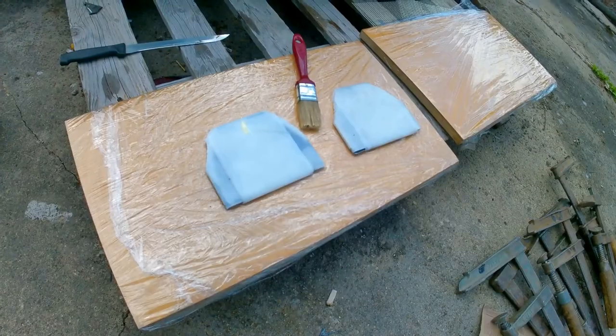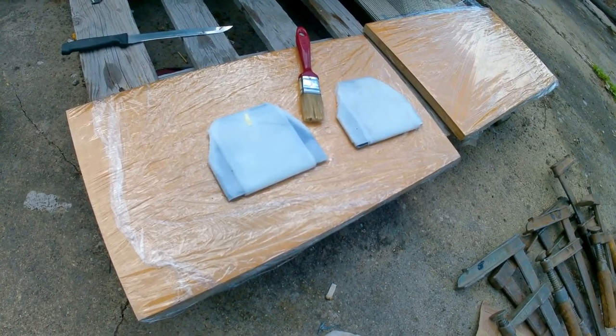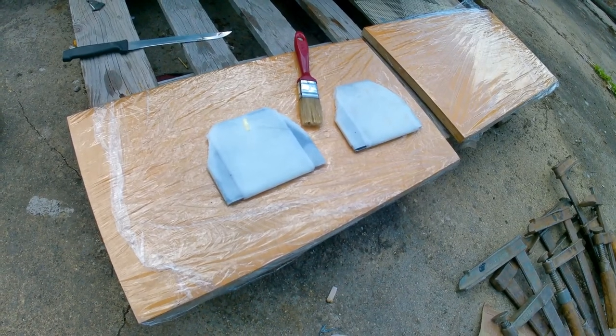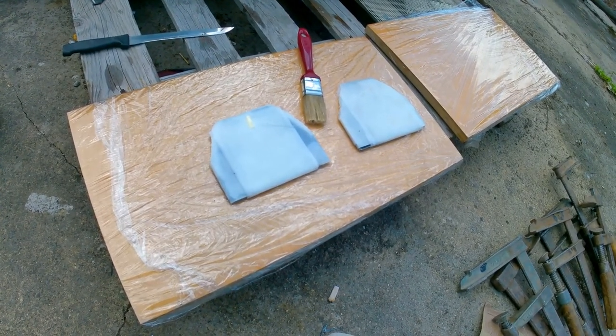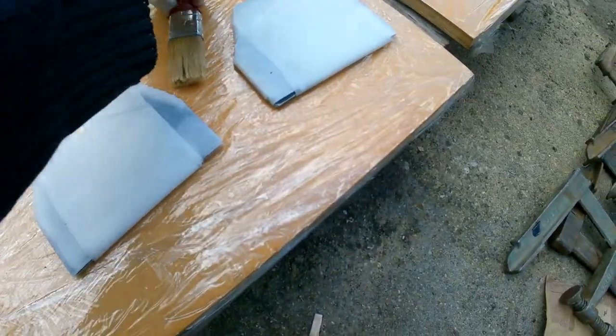We prepare the armor plates in the press, mix the epoxy and make sure we soak both sides of the plates very well with the epoxy. This might take a few minutes and is quite a messy job overall. Make sure to wear gloves.